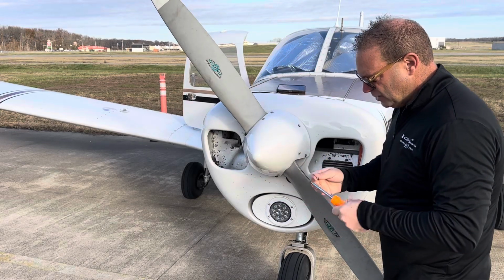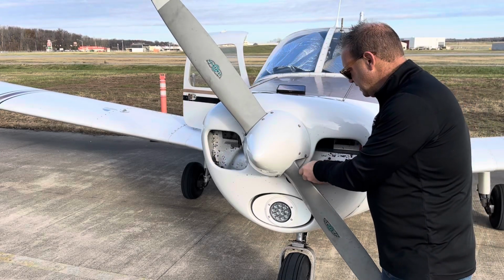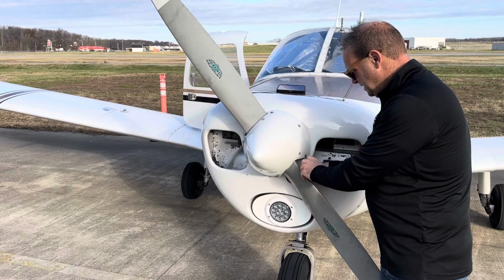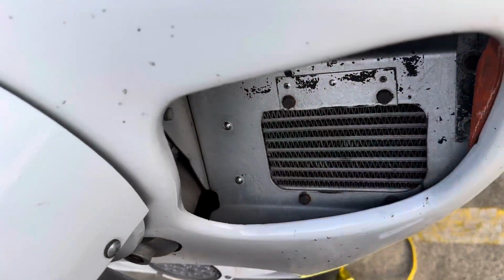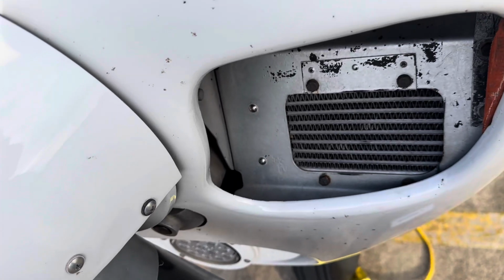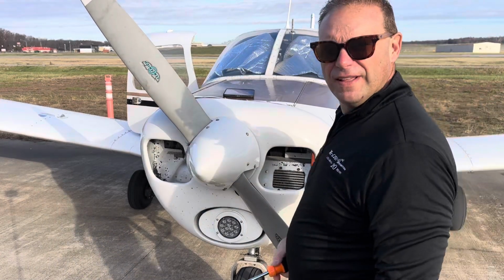Okay, and these are all something that is part of the pilot's operation. It's part of the POH, part of the winterization kit that they call this for the addition of the aircraft. So now I'm gonna thread that back in. Now I'm gonna come grab you here, and you can see right there, you can see where we got it. We got our now clear oil cooler plate, and our 2 screws are back in their hole. Okay, so that is our oil cooler plate removed.